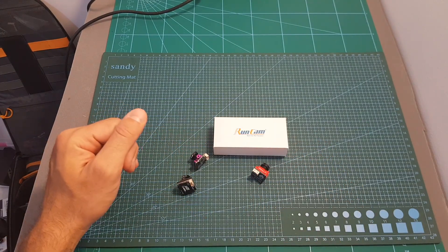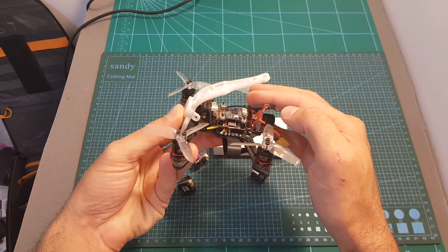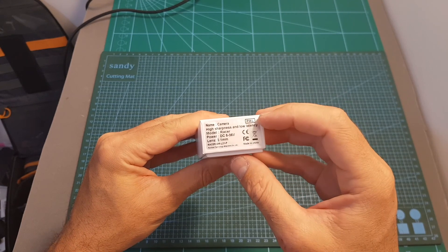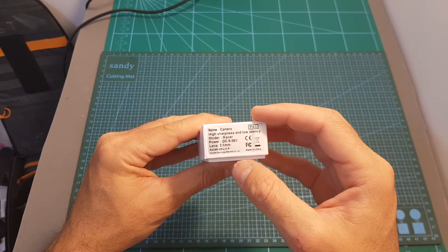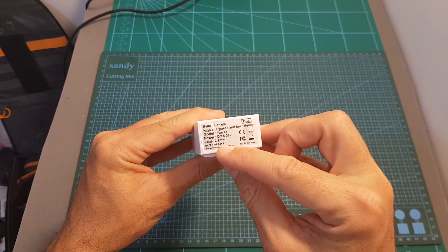After this comparison I'm going to mount it on my Tomoquad Sidewinder and head outdoors for a test flight. The Runcam Racer is available in two versions — PAL or NTSC. The aspect ratio is configurable through the OSD, so you can set it to 16x9 or 4x3, and it comes with only one lens option which is 2.1mm.